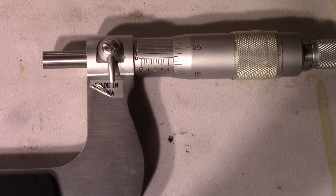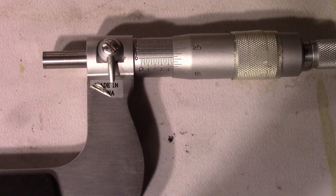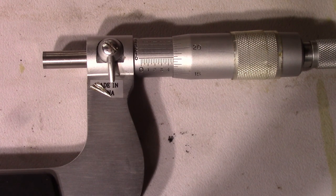So I'm going to go through and do the rest of the main journal bearings, get all those measured up. I expect them all to be pretty close to that value. Then I'm going to turn it 90 degrees and do all those same measurements again starting back from the beginning. When I'm all done with that I'll give you the results. My explanation there probably wasn't great, but look for a YouTube video that makes sense to you.